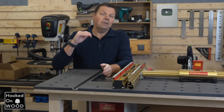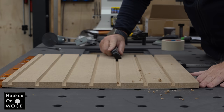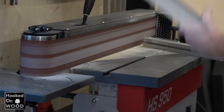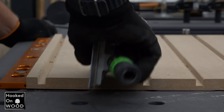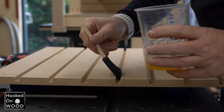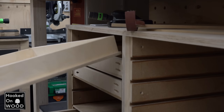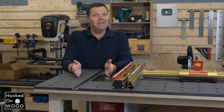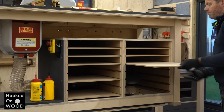The last thing I want to show you is what I did to make the drawers slide smoothly. The most important thing is to avoid creating too big tolerances — when you leave too much space for the sliders, they will wiggle and get stuck while sliding. I made a slight bevel at the grooves and cleaned the drawer's edges. I also sanded the track on the underside to make it smoother. When you leave it here, your drawers will slide at their best. However, you might want to add some finish to harden the surface. I used some Rubio Monocoat for this, but there might be better options. Because of this, it slides slightly less easily in the beginning compared to an untreated groove, but it will probably last longer.